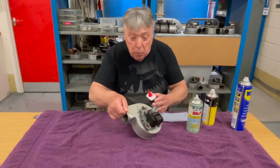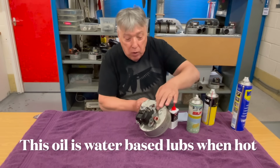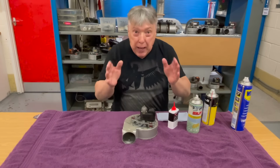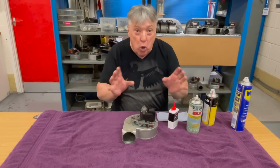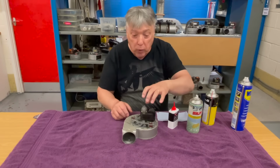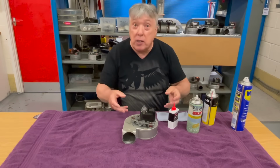And we've got to repeat the process very slowly at an angle so we can just put a few drops in here to hopefully push it down and again move the spindle. And eventually this should be more than loose enough to put gently back into the housing on the flue, check all the seals, the washers, the O-rings and the screws are perfect, plug the fan in, put a cover on, because when we switch this on, we want to make sure that the tube to fire up the boiler, the blowing tube, do you remember? That's disconnected, so the boiler doesn't fire up.